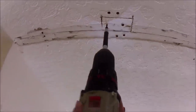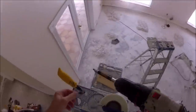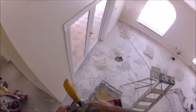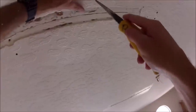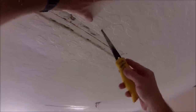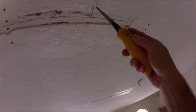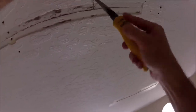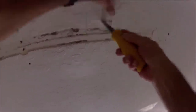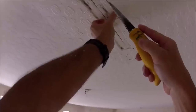I'm going to be using fiberglass mesh tape and a 20-minute setting type joint compound, which will make this super strong. I guarantee this isn't going to crack again unless there's some truss uplift or something like that. I'll speed this second one up a bit — keep watching because I'm going to show you how I mud this after I put on the fiberglass mesh tape. Again, I'm cutting that little piece out and I will reuse it.